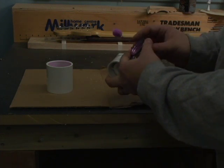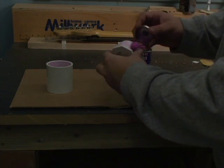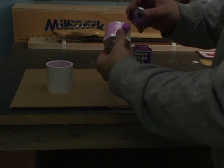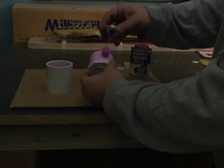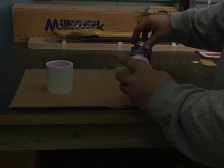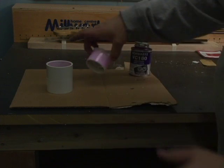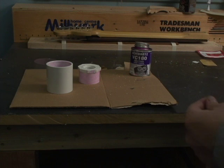I am going to go ahead and do that to all our couplings and to the outside of the expanders — anywhere there is going to be glue in the future, I prime it. It stinks — you should do this in a well-ventilated area, which I am not in right now unfortunately. Do not prime the threaded side; that we do with Teflon tape.